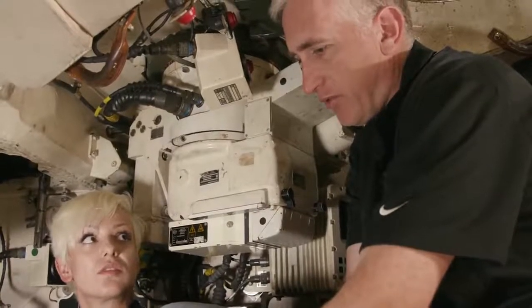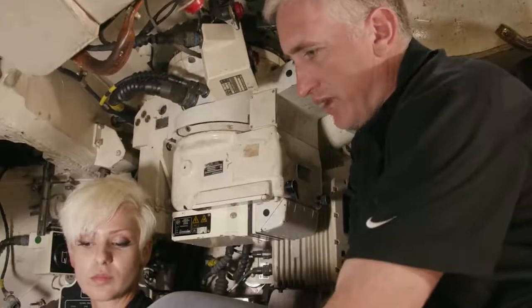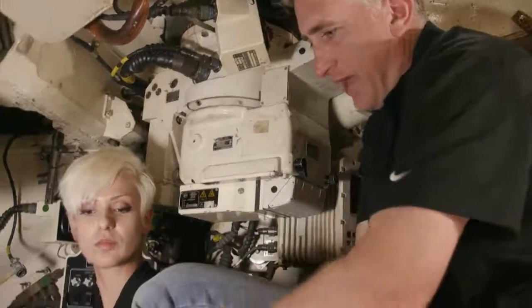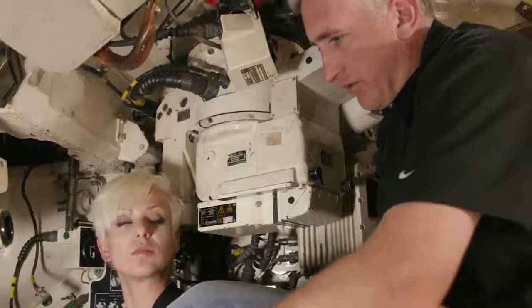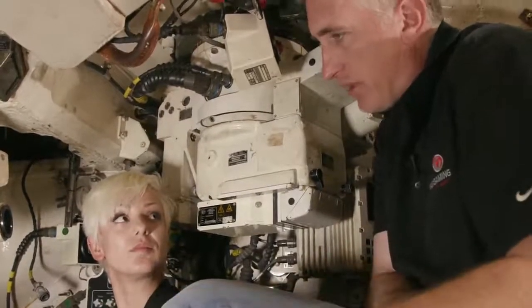So if the index tab, or I can't remember the exact name of it, is up at the front left. Let's say it's in the breech lock ready to fire position. As it goes right, it triggers it, comes back, it starts the extraction cycle, comes left, you feed the round, comes forward, and it locks the bolt. And this electric driven motor is what actually operates the gun.